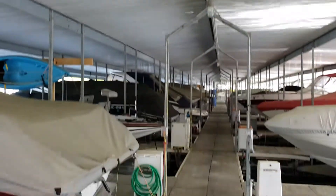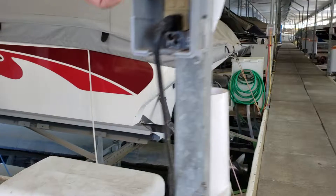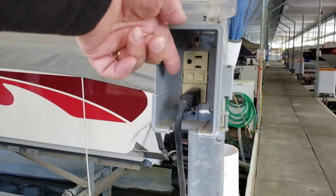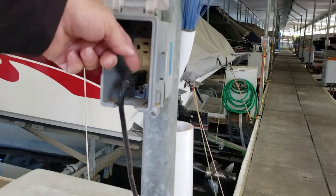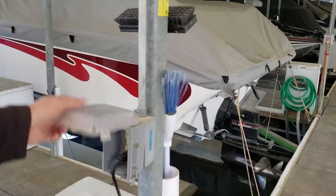What they've done is put GFCI outlets here. So this means the only thing that's GFCI'd is from this outlet switch out. None of this conduit, none of this frame — all that can be electrified.